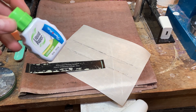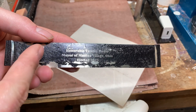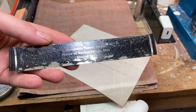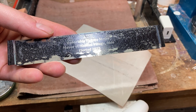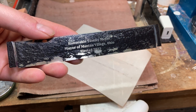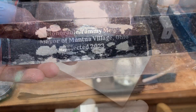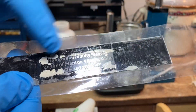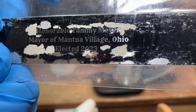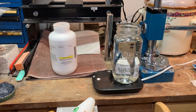Whiteout is also a great masker for ferric nitrate. I'm going to use packing tape to mask off everything around the words, and then very delicately paint the whiteout around the words where we want to continue masking off the acid. Here's where we're at: I've masked off around the words with packing tape on the front, all around, and back, and then used whiteout with a toothpick in the detailed areas to mask everything I didn't want etched.